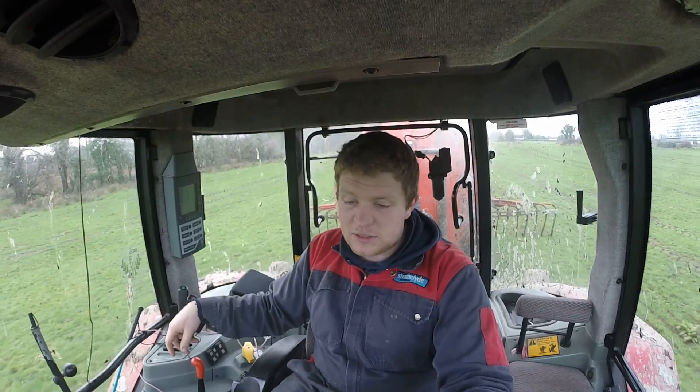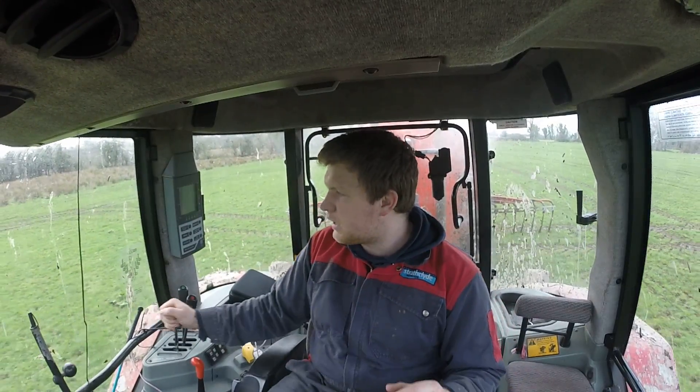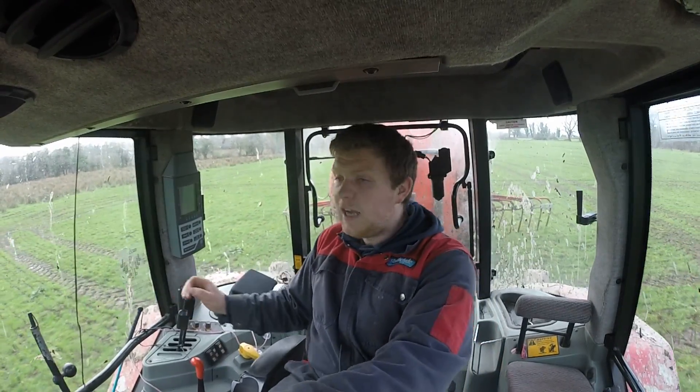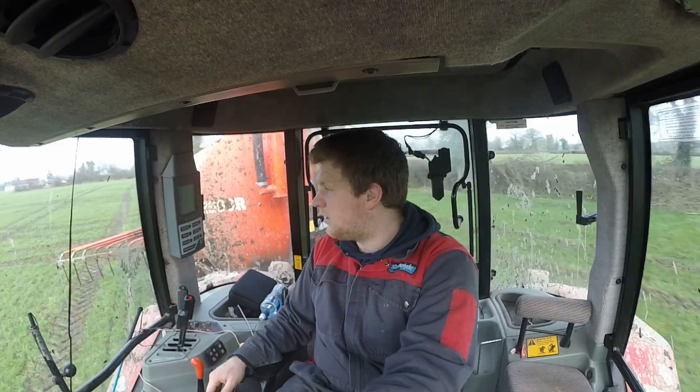Working away now, I'll get straight into it. The tanker - great job, there's practically nothing I could fault it on. It's got me very well, lots of work done, never gave me trouble at all. The only issue I had was with the pipes on the dribble bar coming off when you'd be letting down the arms or blowing out - those are the two times they'd come off, and for a while it was quite annoying. What I did was file a burr onto the clamp - the ring that you tighten onto it - so it works like a set of teeth grabbing the pipe and holding it. None of the pipes have come off since.